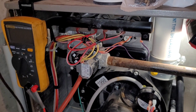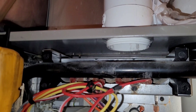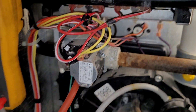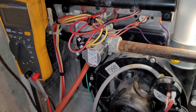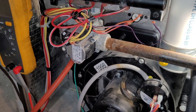This one's all put back together. Now I'm going to explain why these gas valves are failing. If you have a furnace where the gas valve sits directly under the burners, you never want the intake pipe directly in the top of the furnace. This causes a ton of condensation and moisture in the middle of winter when all that cold air rushes into a hot space — it soaks the gas valve, it's just wet all the time, and eventually they fail.